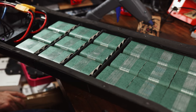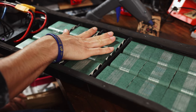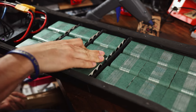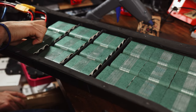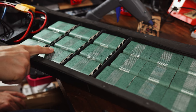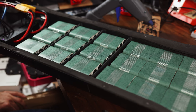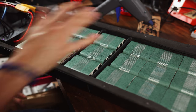And yeah, so the nickel for these, I think I'm going to try and get some 6P pre-cut strips, because I only have 25 millimeter wide nickel, which is only wide enough for just the sides. I need it to go up and over. So yeah, I need to figure that out still, but find out in a few seconds. But for me, it will be however long it takes me to figure out that solution.